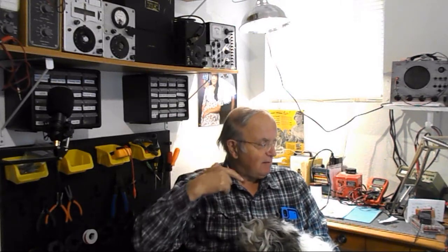That's what's taken me so long. I'm trying to go back in and find out what he changed and what he did, and I'm having to take stuff apart and go back to the schematic and then figure out if it's wired in right. And so far it has been. It's just he's got a lot of weird stuff he's been doing, plus a lot of cold solder joints, and some wires are bare that are not supposed to be bare. So yeah, that's been kind of fun.